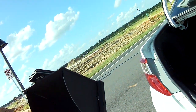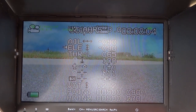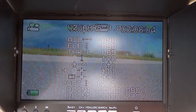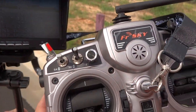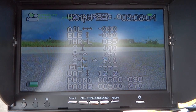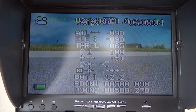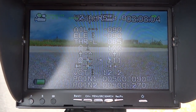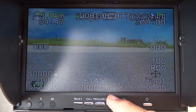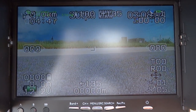I am going to set the home position. Go down the right stick, get the manual out, and set the home position — bring it down to the home. Hold it all the way to the right for about 5 seconds until you see the hourglass. That's the home position being set. We've got 11 satellites — that's really good. Home is set. You can see it's at zero meters, which helps you confirm you are at your home position.